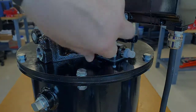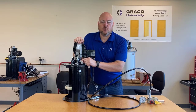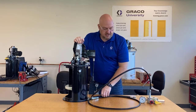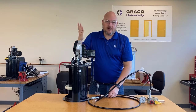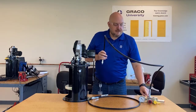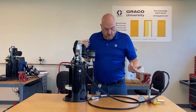You want to put some liquid thread sealant on this — not Teflon tape, but liquid thread sealant. I'm just dry-fitting today. Now that I've got my street elbow installed, I also installed a 3/8-to-1/4 inch adapter because I'm working with 1/4 inch hoses today. Quarter-inch hoses are big enough for short runs — these hoses are each about six feet long. For longer runs you might want to consider 3/8 hose, which is part of the reason we use that porting.